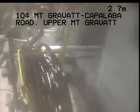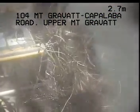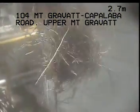Okay, before I go back down, excuse the meterage. As I say, I'm working off the ladder, so excuse the meterage. It's not accurate at this point. I'm out of the drain. This is what I've pulled out with the reverse cutter, as you can see there. That was what was in the drain. I'm just going to head back down the drain now.